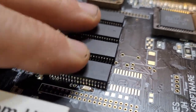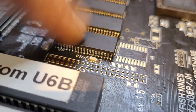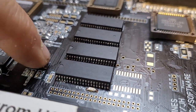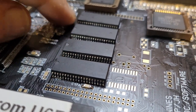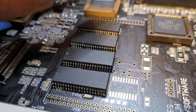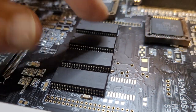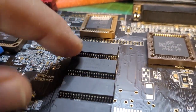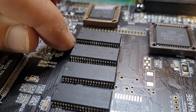Before we continue, just a few more comments on these guys. Again, take your time, and take the extra effort to check continuity and double check with your schematics. I know it's tedious and annoying, but it'll most likely save you time in resoldering, not being sure what's soldered properly or not. What I did is check continuity on each of the pads, checking that it matched the next one. For the couple of lines that aren't connected, like the chip enable and the write enable, you can check with the output and trace them back to where they're going, or you can very carefully check, if you have thin enough probes on your multimeter, for continuity between the bottom of the pad and the top.